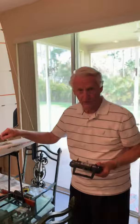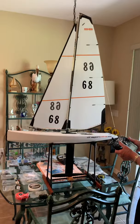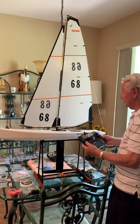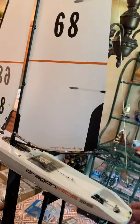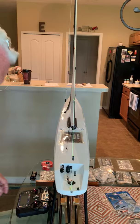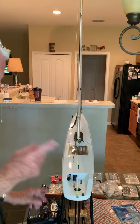Now check basic tuning. The first thing I'm going to do is take a look at the boat all over and see what I like and what I don't like. I just pulled the sails in — now take a look. Look at this: put the sails in, look how tight this is. That's too tight. We want this end here to be up and pointing over to here, so we have to slack this off.